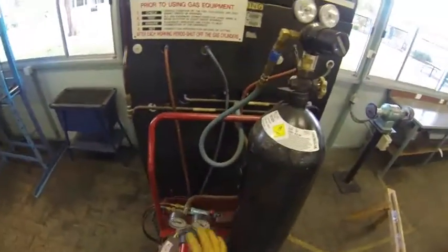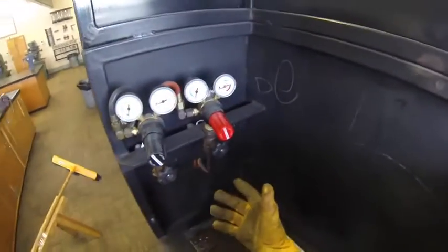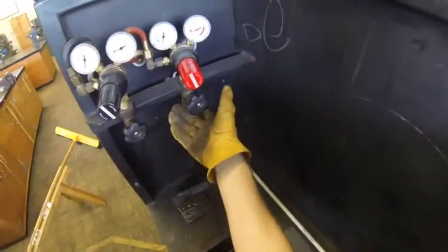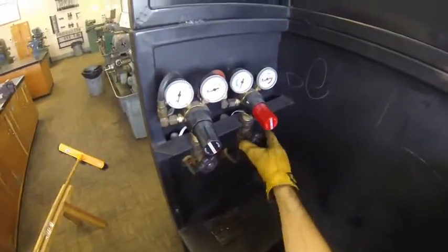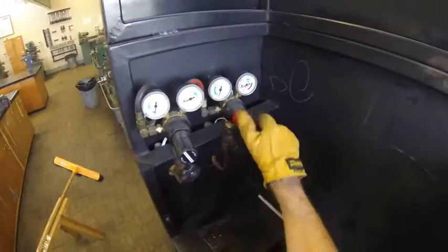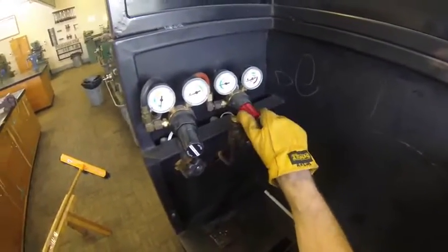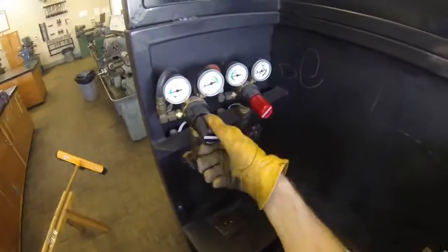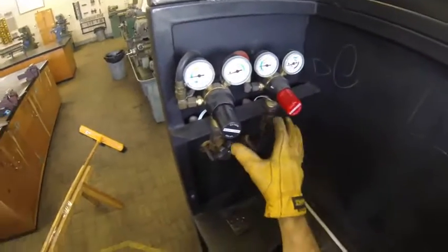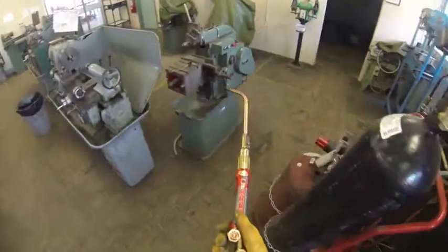That has allowed the acetylene and the oxygen to go into the pipes. I then have a separate individual regulator for this handpiece. Once my handpiece is off, I need to turn on my acetylene, turn on my oxygen, and open those taps right up. You'll notice nothing's on the gauge — I need to wind in the regulator, and obviously it won't go any higher than what I've set on the outside cylinders. So the regulators are on both, the taps are on, and there is now acetylene and oxygen in my handpiece, but both have been turned off.